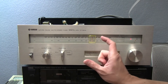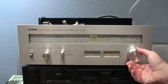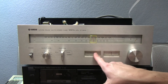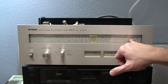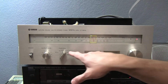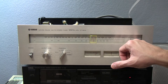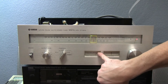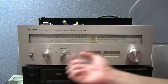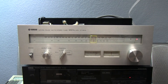Beautiful dial, everything is working — perfectly good sensitivity and good selectivity as well. A station with a very strong signal here. Good overall, although despite the strong signal this one's not transmitting in stereo. Then you go to auto — you actually increase the sensitivity in this position, but at the expense of selectivity, so you may be more susceptible to interference. You see how the signal strength increased with the distance mode because you increase the sensitivity. So that's the basic operation of the tuner — overall pretty impressive.